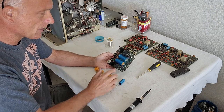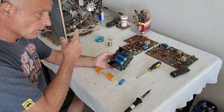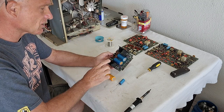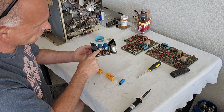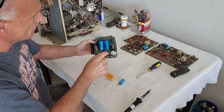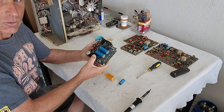This is power supply two for this unit. There's two parts to the power supply — one runs the motors, the other one runs the other features on all the other cards. This is part two. I told you on these capacitors, they're all dried out, dead as a doornail. These things are leaking like a sieve — this one, this one, even this can one. Disaster, folks.